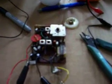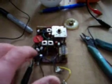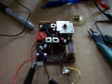Some of them were almost double the amount that they were supposed to have been originally. And this radio was in operation when I bought it, and it popped one of these two capacitors down here about 5 minutes of playing after I bought the thing. So they needed replaced. They were getting to the end of life. And I think this radio is somewhere between 1958 and 1962.